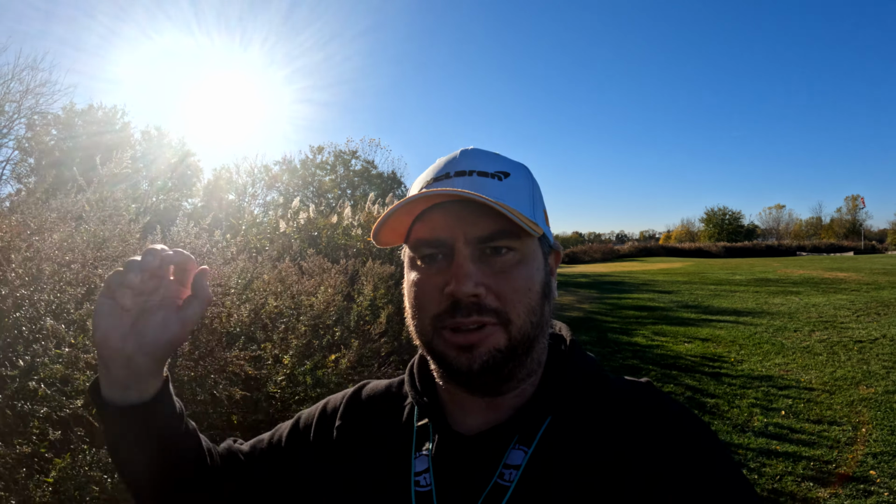In addition to the setup process being pretty seamless, the tune that comes on the build is very good. It's very conservative. It's not gonna push your drone to the absolute max, but when you're flying freestyle drones, you don't want a tune that's at that bleeding edge, because if you nick a prop flying through a tree or a bando, you're just gonna have a bad day and you might not even be able to limp your drone back. So I tend to run conservative tunes anyway.